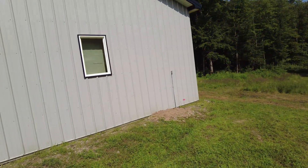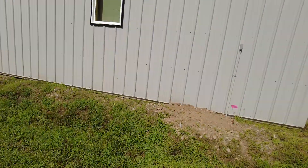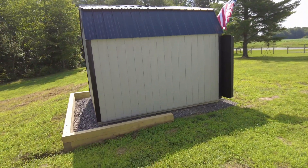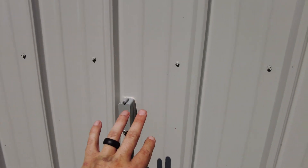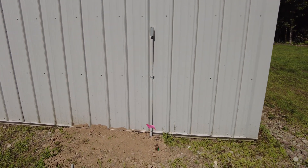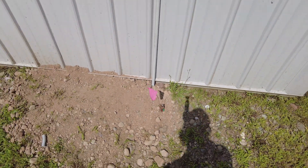To get power from the shed to the house, I'm going to run underground conduit — get one of these conduit bodies and connect the powerhouse underground with a trench all the way up to the house. Right on the other side of that area of the house is going to be the AC breaker panel. What you see there is me just getting started and hooking this up. We have a ground wire and a ground rod, and that's what you see in that half-inch conduit.